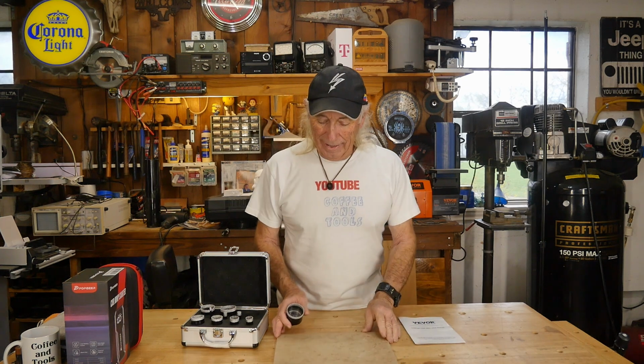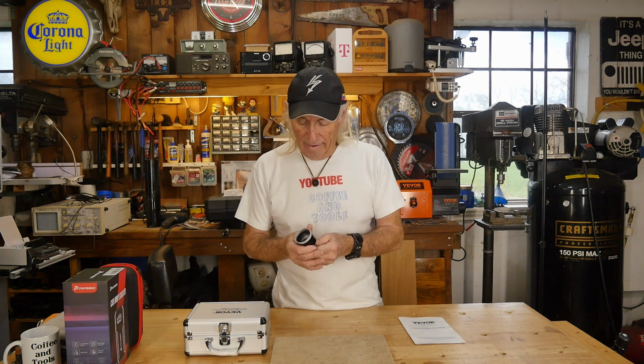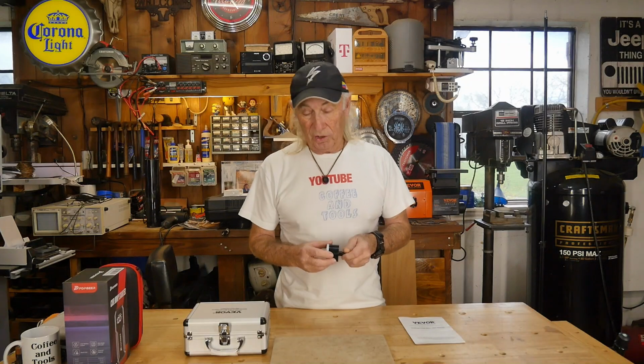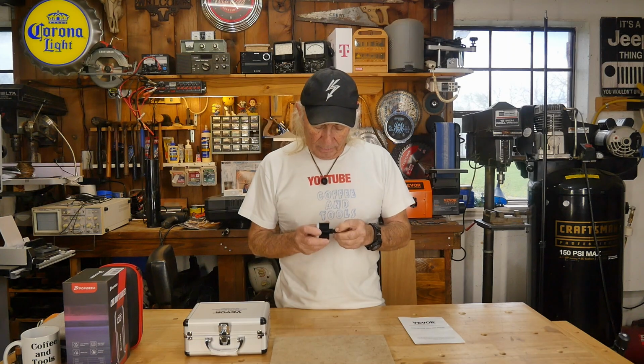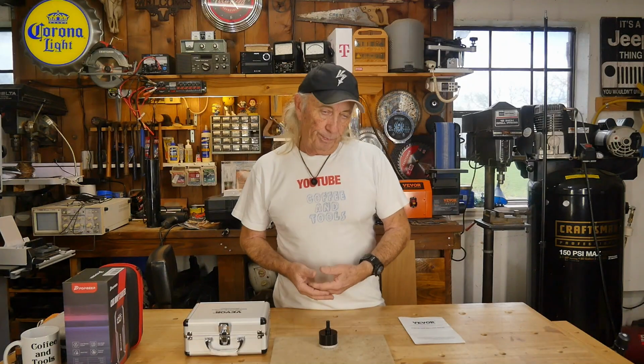And I guess we're going to try something a little crazy. It says wet or dry, and I've always done the wet thing for cutting any kind of tile. It keeps the fumes and garbage down anyways, I think, but it also helps keep the tool nice and cool while you're doing it. Now, the other problem is I'm going to need a high-speed drill, and I've got lots of battery stuff here. Those are not high-speed drills. They're nice to use, but they're not high-speed.